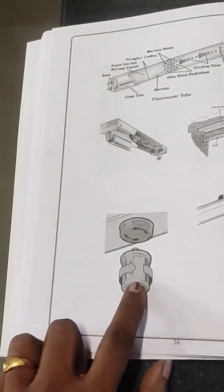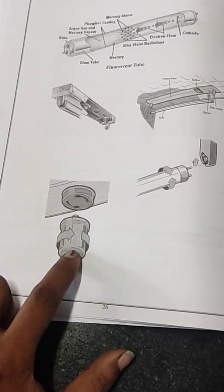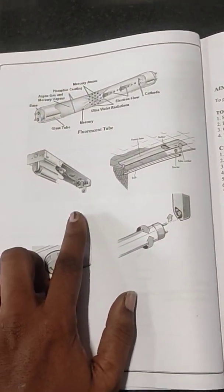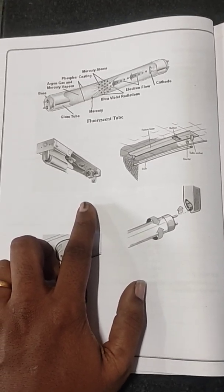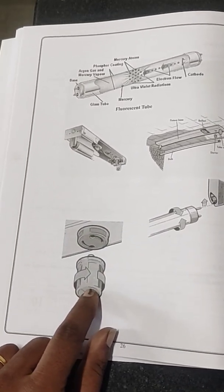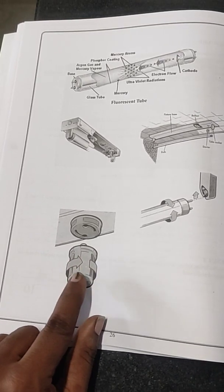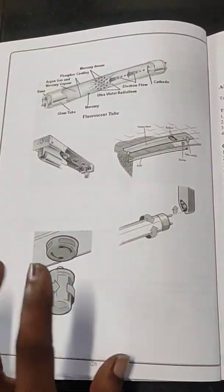This is said to be a starter. The starter acts as a limiter circuit, and is also called a limiter circuit. The starter also acts as a protector. While ionizing the inert gases, we need to use a choke or ballast arrangement, which acts as an amplifying circuit — the power required to ionize those gases is created in the choke arrangement. With the help of the starter, it acts as a limiter with a certain range of 40 watts. When 40 watts is exceeded, the starter will fuse itself and protect the lamp.